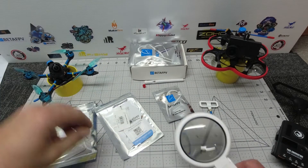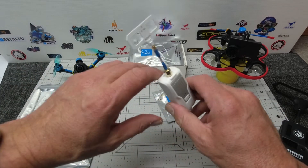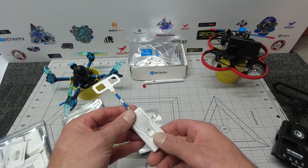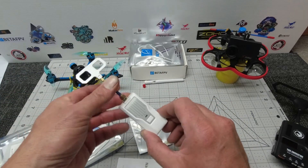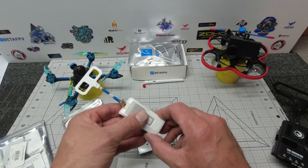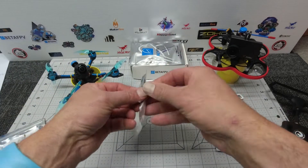With smoke stoppers and all that it can be a real pain, but ExpressLRS is fantastic — you just put the receiver onto your quad, power your quad up, press the button, and the job's done. That's ideal for people starting out in the hobby. A short press of the power button does the binding; a long press enters your power options, letting you switch between available power levels. The LED tells you your output: blue is 100 milliwatts, purple is 250, and red is 500. Nice and simple.